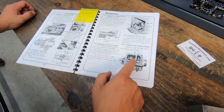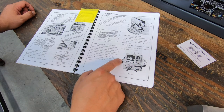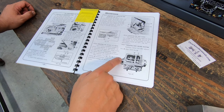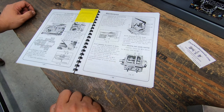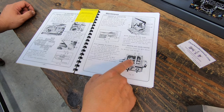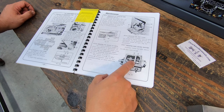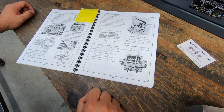While being very simple instructions, there's also a nut on the back end of the spindle and the manual doesn't say anything about that bearing. If it says it somewhere else in the manual, I haven't found it yet. So what we're going to do is loosen nut A, adjust nut B, and then we'll do some test cuts and see if it actually helps improve the chatter.